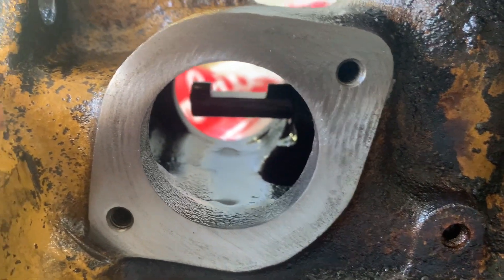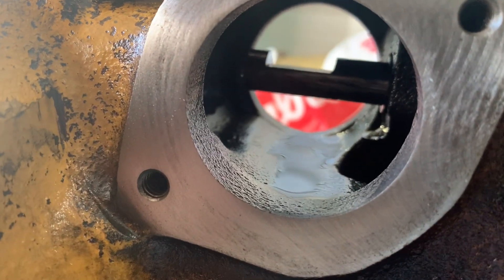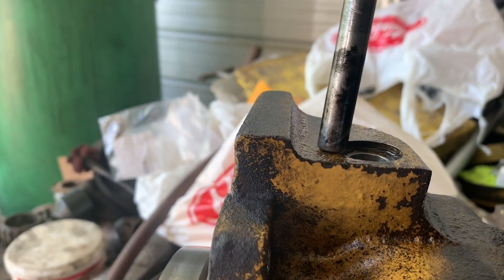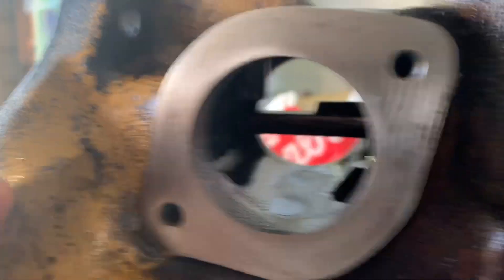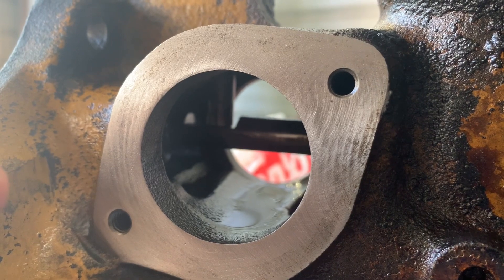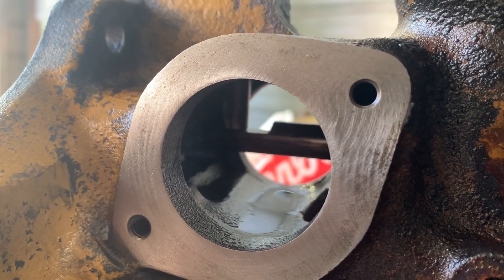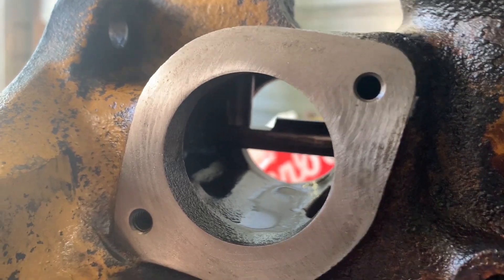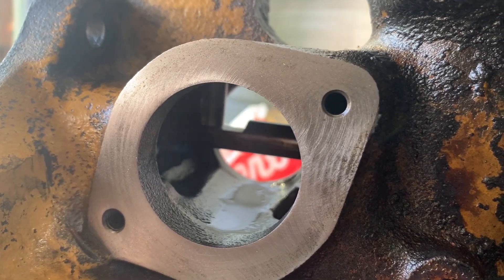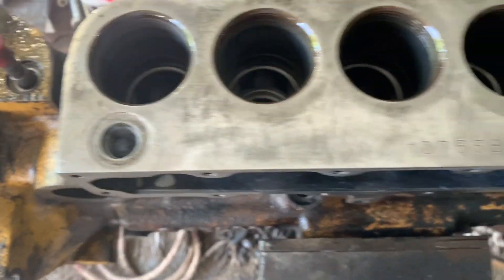See the rack there? See the groove? So as we put these individual barrels in, we will drop our pin - this normally has a plug in it. Make sure it's clean. You take the plug out and drop this in - see it rests on top. What you want it to do is fall down into the rack and then pull back tight against it. It's got to be back solid against the pin. In that position - whether the governor's on it in the truck or like we have it apart right now - that's where it has to be when you drop the pumps in.